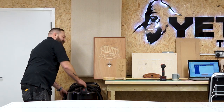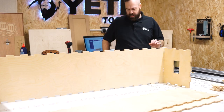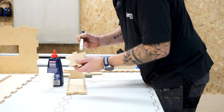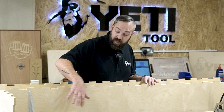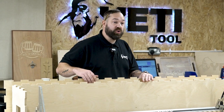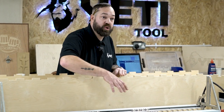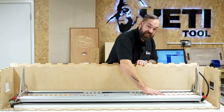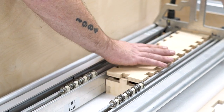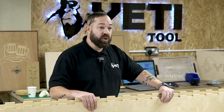Remember guys, as always, a clean workspace is a happy workspace. So this is the stage we're at so far — we've cut the first sheet and assembled the ends to the base and one of the sides. In reflection, I put the lid on the first sheet when it should have been the second side, but that actually gave me an opportunity to access the inside of the box to do the internal work. We've got the lids cut for the internal boxes, and on the second sheet we'll have the plates that sit over and fix the upper part of the X-beam to the flight case. We're ready to load the second sheet of stock onto the Smart Bench — the file is already on the console, so we'll press go and get the next parts cut.